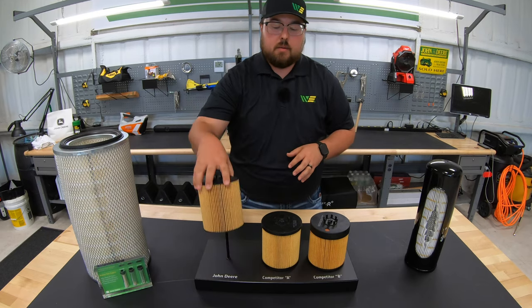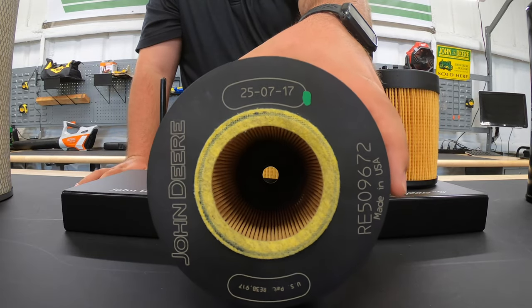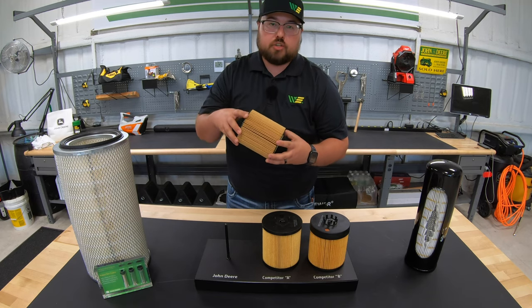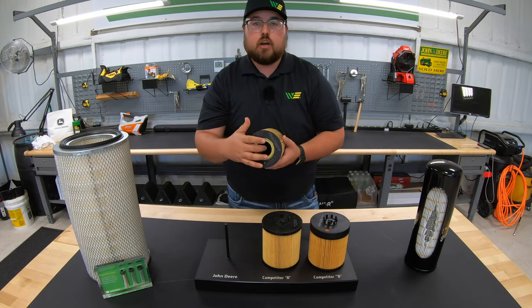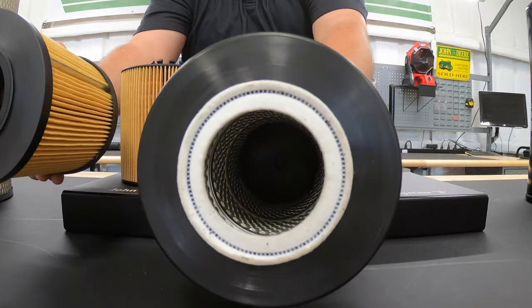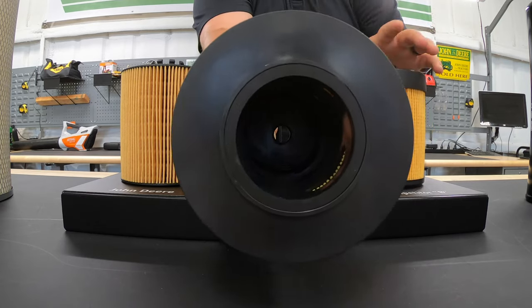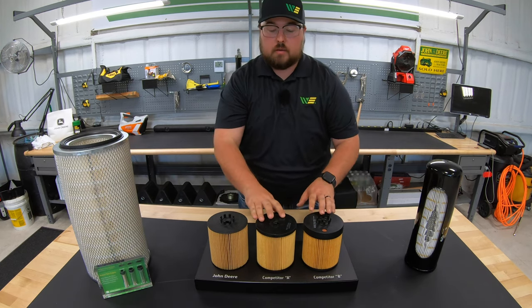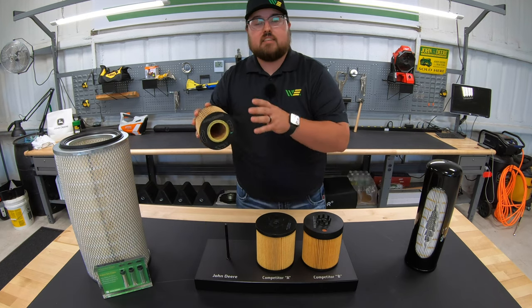On the interior side, most filters come with a center tube, but on the John Deere there is no center tube — you can actually see the pleats on the inside. The reason is that with this drop-in filter designed for John Deere machines, the housing already has that center tube built in. Our Wix and Baldwin both have a center tube: the Baldwin has a standard metal center tube, and the Wix has a plastic center tube with holes on the inside. These will still work in those applications, but just know the tube was not needed as it is built into the John Deere housing.